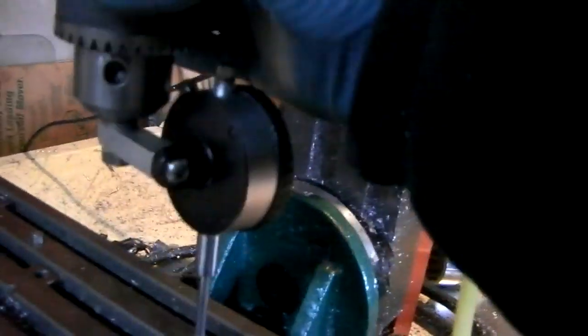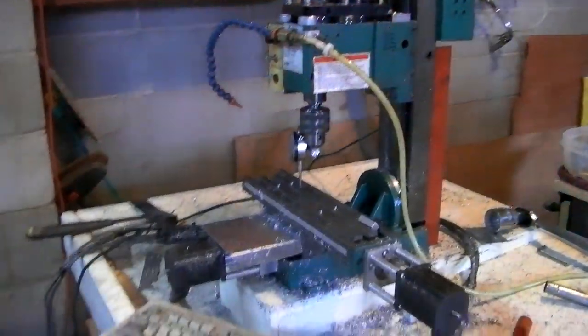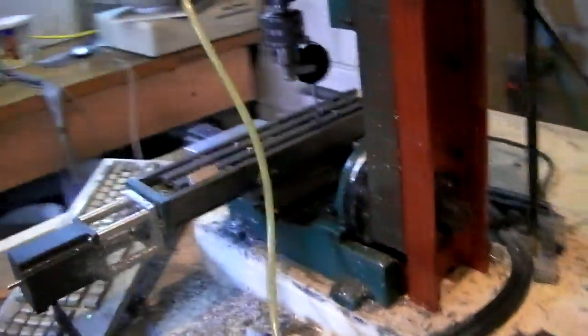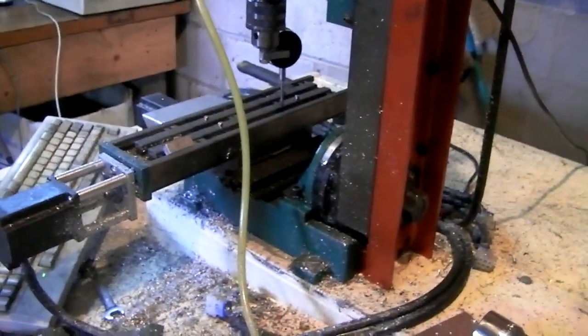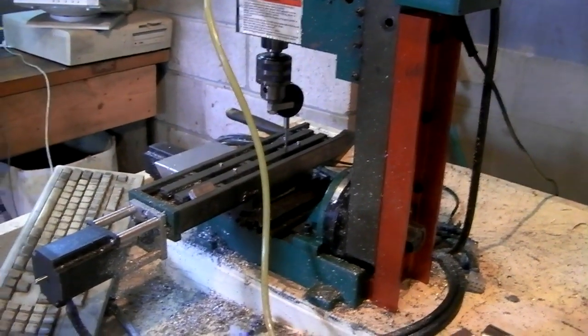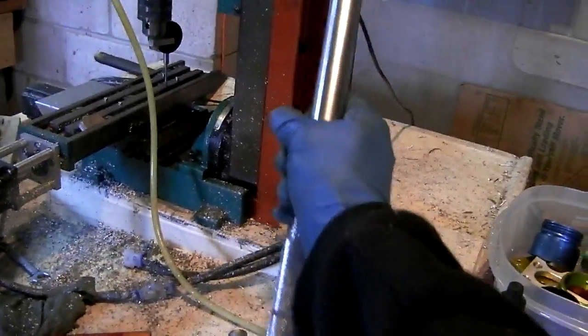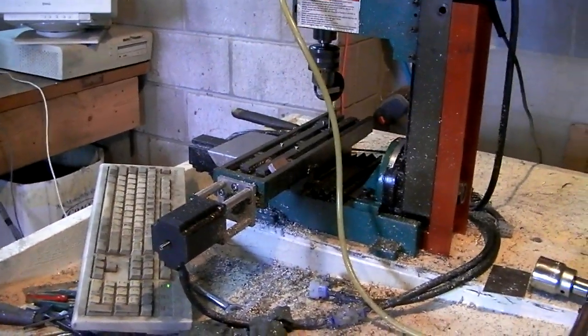Left to right — let's see — that's two thousandths, and over here it says negative two. So we're a few degrees off. Side to side adjustment is going much easier. I've just got the bolt snug tight in the back and I can use my hand to adjust side to side since it rotates. It's only taken a few tries to get it within one thousandth of an inch, which is my goal. Now I'm torquing it down with my torque wrench to 50 foot-pounds — I wrote it on the machine so I don't forget.